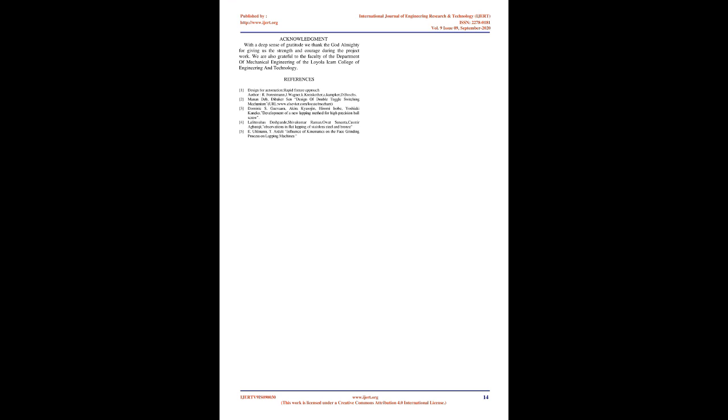(4) Toggle Switch (Fig. 9): used for controlling and allowing air flow through the ports of the double-acting cylinder. When the toggle switch is pressed initially, air flows through the port near the bottom dead center of the cylinder. When the piston is actuated at the bottom dead center, the pressed switch is reset automatically.